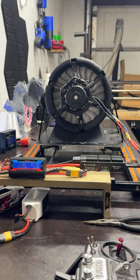On this one I'm pushing a lower kV motor, because I had an 800 kV on that one, which ran fine, and then a 650 kV because the 800 was getting hot. So, just throw it to full power? I think it would blow up if I did that. It definitely stripped the gears pretty quick. So we're going to go up as fast as I can, but